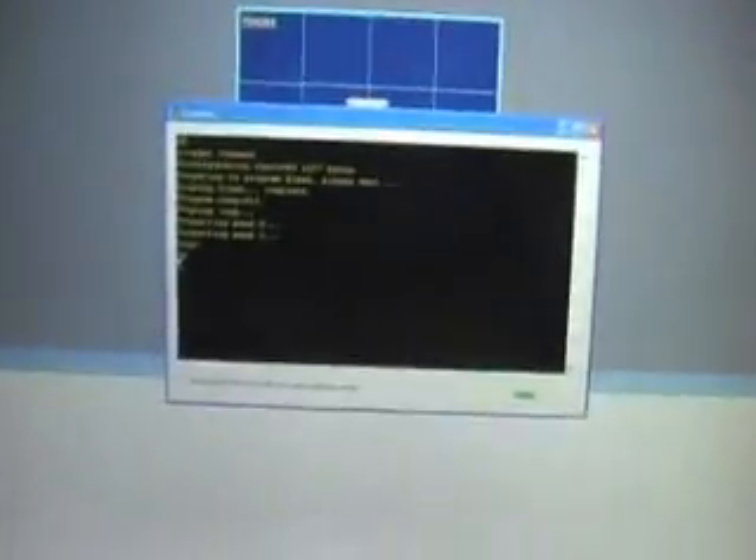Go to Application mode - type GA - and the panel should reboot. Then it's installing, and then it's back to normal. As you can see, I have changed the message. It now says on the top line: 'Protecting the Turner household 24 hours a day, 7 days a week. System is normal.' So that's how you upload software to the FireFinder.